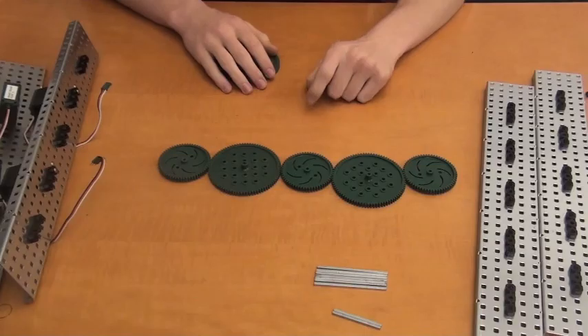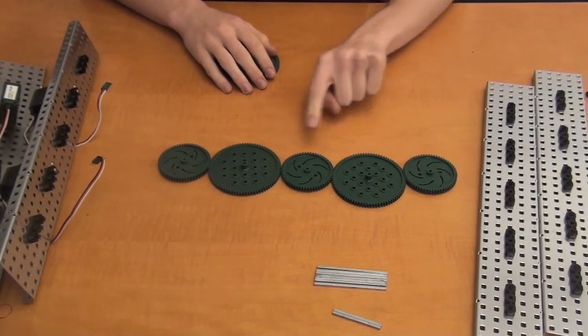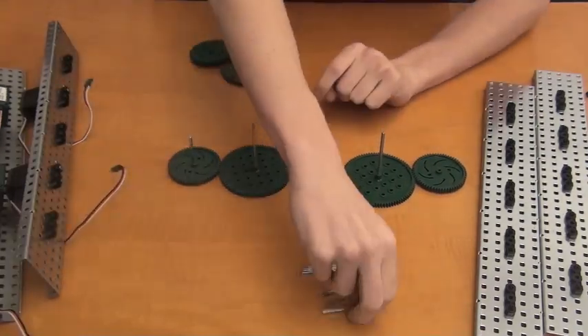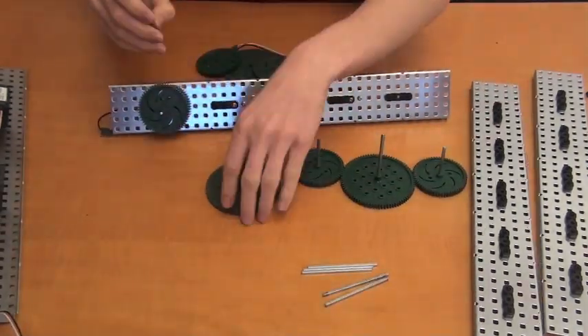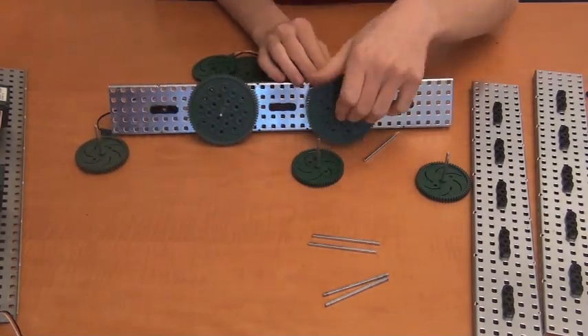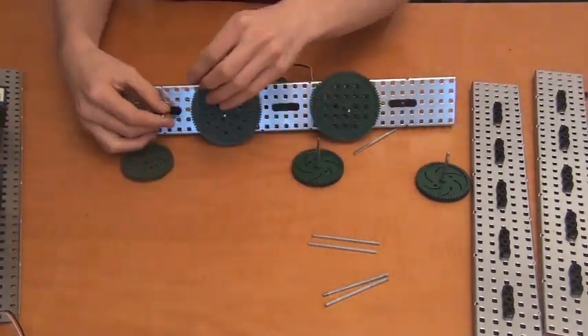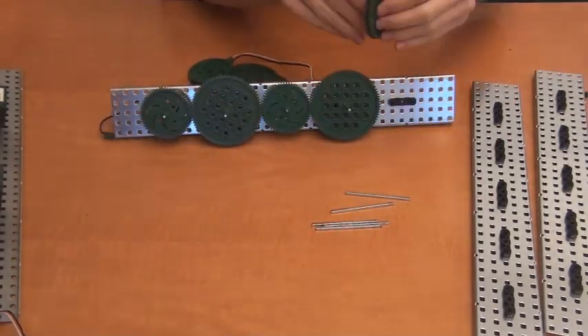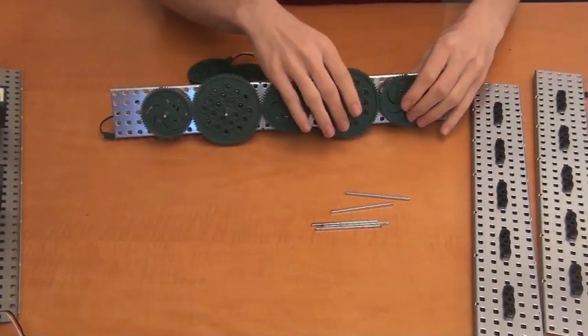The next step is attaching the gears and shafts. To construct the following demonstration, you will need two 84-tooth gears, three 60-tooth gears, two 3-inch shafts, and three 2-inch shafts. Attach the two 84-tooth gears to the motors you mounted previously and the three 60-tooth gears to the remaining open bearing blocks. Between the 60-tooth gear and the bearing block, there needs to be a quarter-inch black spacer so that it looks like this. The weighted gears placed in this demonstration set the robot up for speed. However, you can mix and match your own gear ratios for the desired performance of your robot, whether speed or torque.